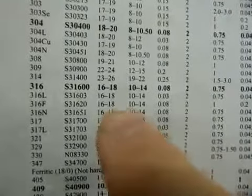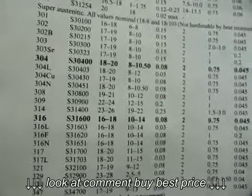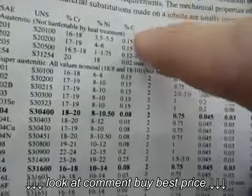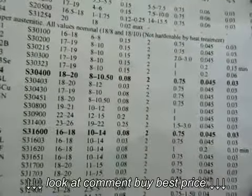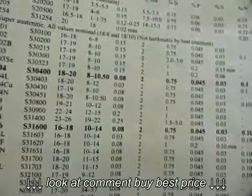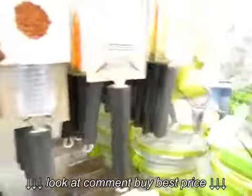So the 18/8s are further down here. Some of them have about 18% chromium and about 8% nickel in it. So the 8, that second digit again, is nickel, and it doesn't relate to the carbon content. Like there's an 8 there and some 8s there, but the first number is chromium, the second number is nickel. That carbon content is 0.08%, not 8%, a smidgen in other words, and has to do with the hardness or sharpenability of steel. So these surfaces, countertops, sinks, they don't need to be sharp, they need to be able to bend without cracking, and that's where these stainless steels excel.